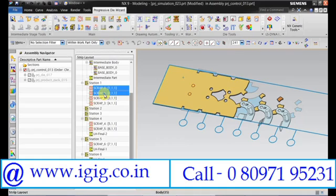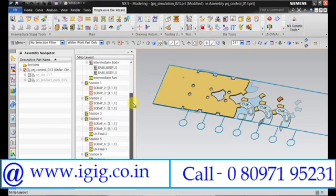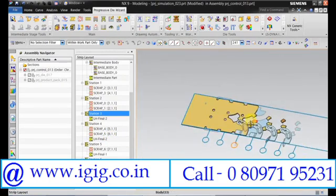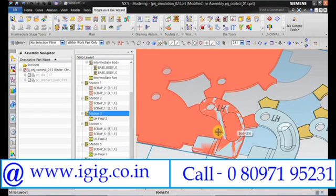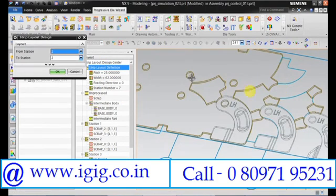You can remove the leaves side here. We can move the embossing to station number 2, and we can do embossing of this profile in station number 3. For that we can copy Final 2 and paste it here, create a forming punch using this profile, and update the remove blank material from station 3 to 7.